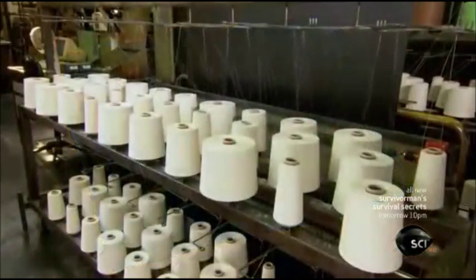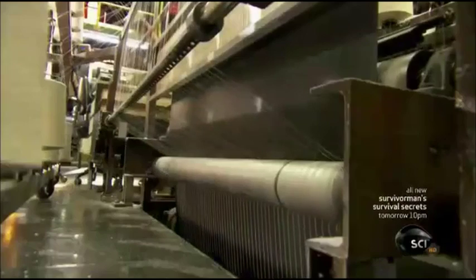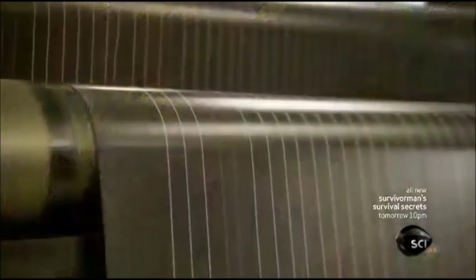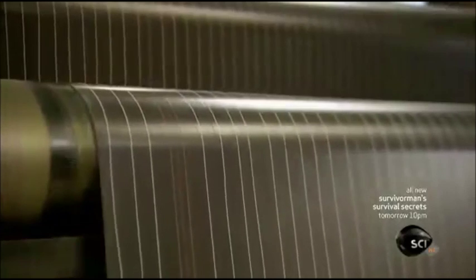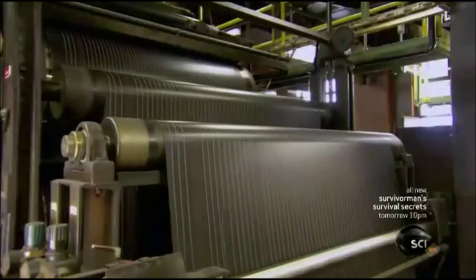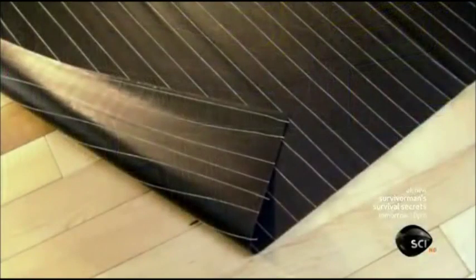Numerous cotton cords now spin off bobbins simultaneously. Machinery pulls them onto the warm rubberized fabric. They land on a bit of an angle and adhere. This cording creates channels that provide pathways for venting air during the actual tire building.